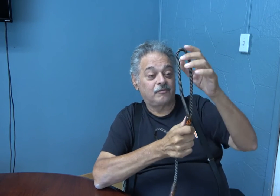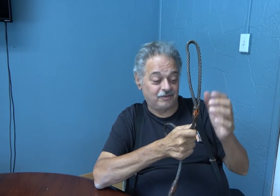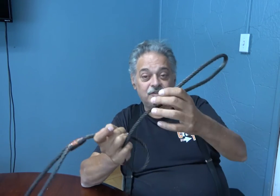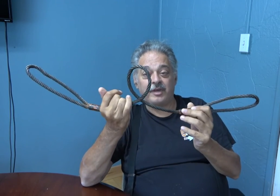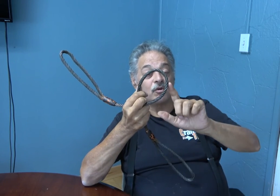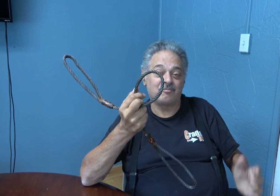This Flemish eye can be just as effective, or nearly as effective, without this crushed collar at all. So the eyes on this are just fine. But the fact that it's been this badly deformed, you have to be concerned about whether there are broken wires in the core of this rope — and that's the part you can't see. If you wanted to inspect it for broken wires, you'd have to cut the rope in half, so you might as well just throw it away at that point.